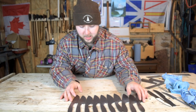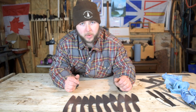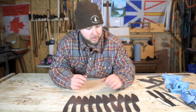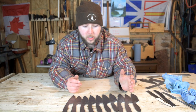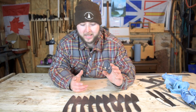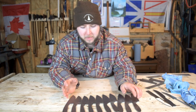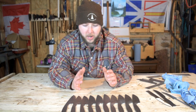So here we are — 10 blades all cut out, perimeter ground, and ready for bevels. I'm not going to do the bevels tonight because I've been out here long enough. Dexterity is starting to go down in my hands, and as you get a little bit tired and you spend a couple hours at the grinder, you get bored and you're not concentrating as much, and then when you start bevels you're more likely to make mistakes. You learn some tricks like that the hard way. Sometimes it's better to just call it quits when you know you're ready for that — it comes with personal experience, but that's what I've found.